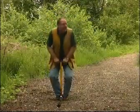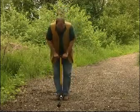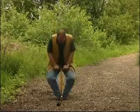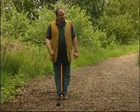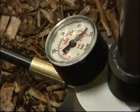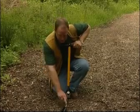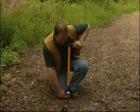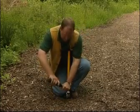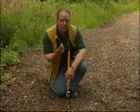I'm trying to fill this bottle from a pump. It needs to be charged to 232 bar. Full. All that remains now is for me to open the bleed valve on the pump, which will allow the pressurized air in the pump and in the hose to be released, and therefore the bottle valve to close. The bottle can now be unscrewed and is ready for use.